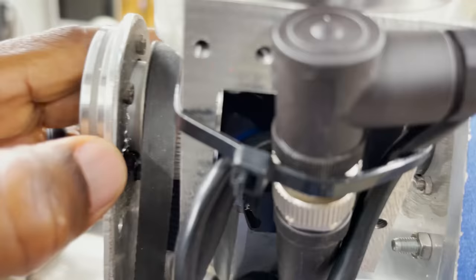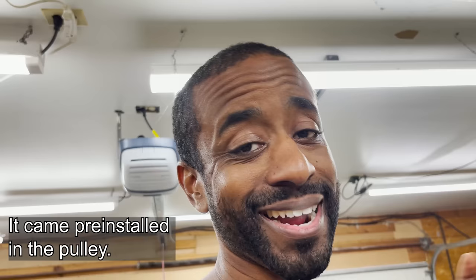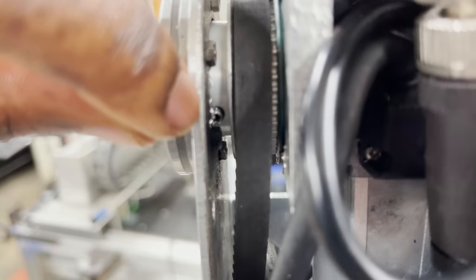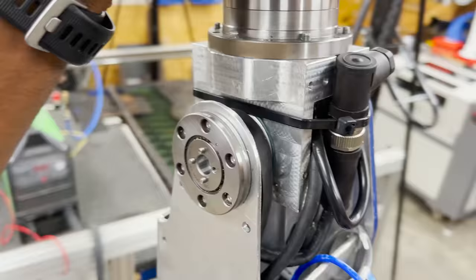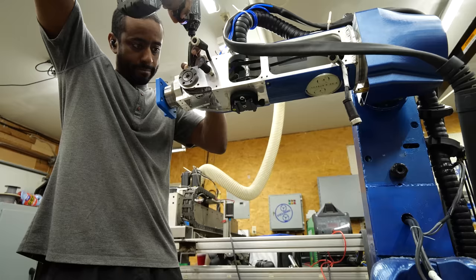This is day three of me trying to figure out what the problem is, and I finally figured it out. See those metal shavings right there? Those weren't there before. And this shouldn't be nearly this hard to turn — you can see right there, there's a set screw that has backed out. That set screw serves no purpose in this assembly; I could completely remove it. But that is what's been causing all of the extra force needed to move this head back and forth, and totally derailed my project for three days. I'm going to take those two set screws completely out because I don't need them, and then everything should be working again.